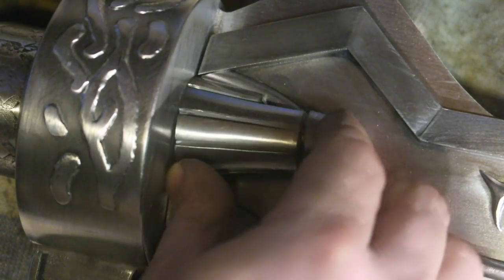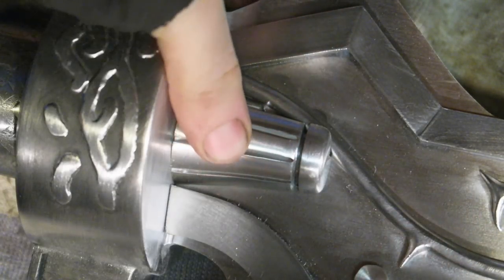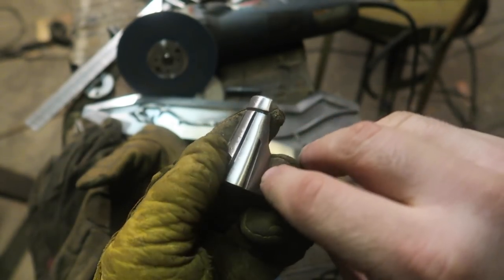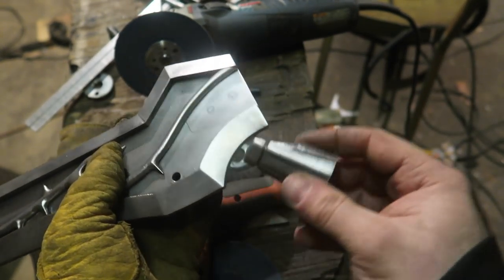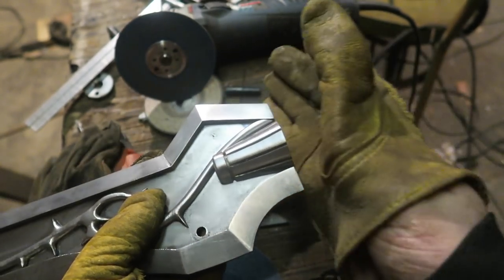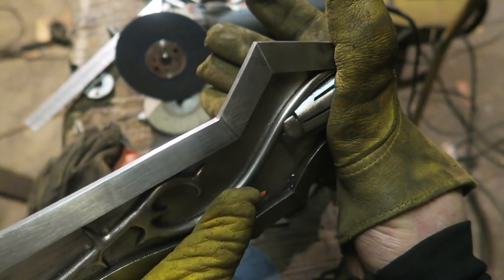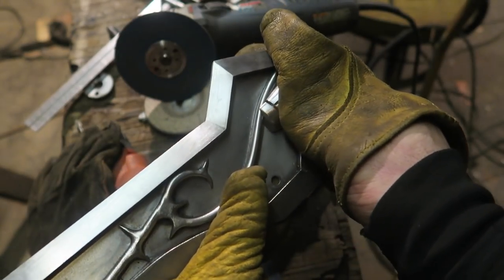Unfortunately, I had to take off quite a bit more than I thought I should have. It's a little bit odd, but that's what I had to do to fit it in there. It didn't quite look like the way that weird cutout was, so I welded in some material, and now this groove doesn't go all the way up, it stops. And so there's extra material in there, so the transition... Careful, this is too hot to hold here. Not quite. Ow! Maybe it is. Oh my god. Come on, glove. I guess I can do it without holding the glove. The transition looks more like that than what it looked like before. So I think that's more acceptable than what it was previously. It's a very odd transition, you know, between the bar, which has a rounded back, and the cone surface.